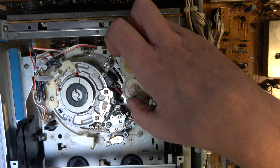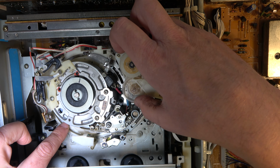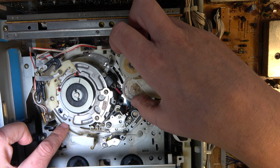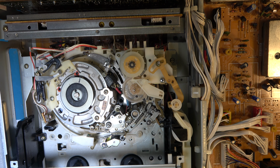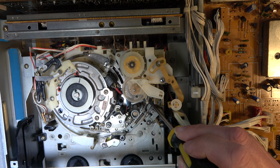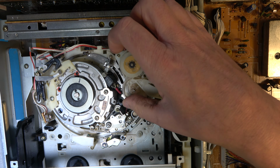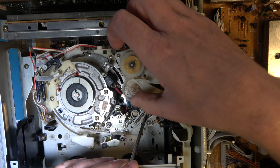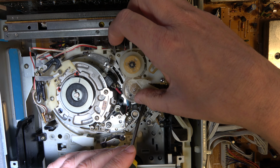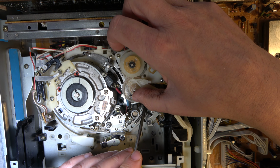So why doing lace? Is this side not starting properly? That might imply stripped teeth, which could be quite bad. Now drive for this side goes through this gear here. And in fact, you hear that horrible clanking noise we heard earlier. That happens if this side is overdriven and the drive gear slips underneath the toothed rack.